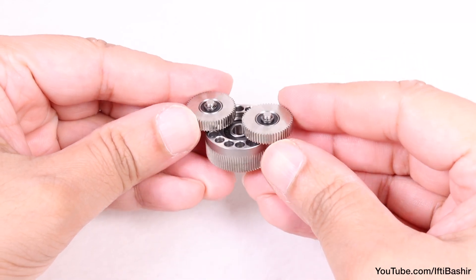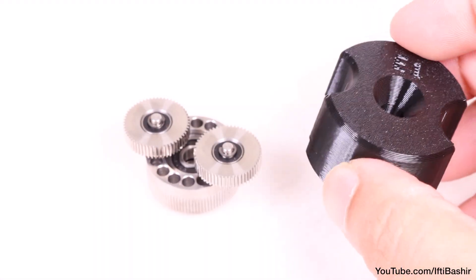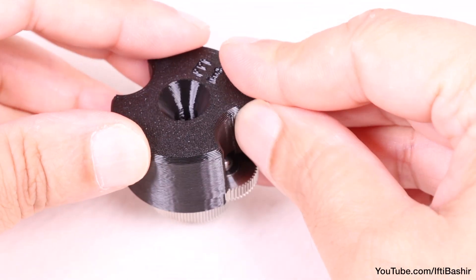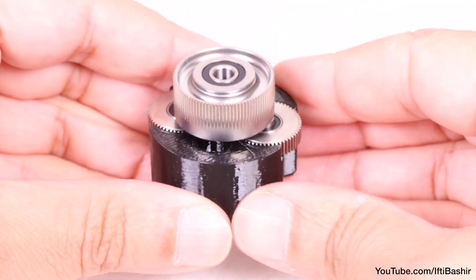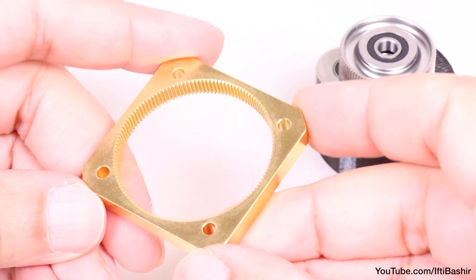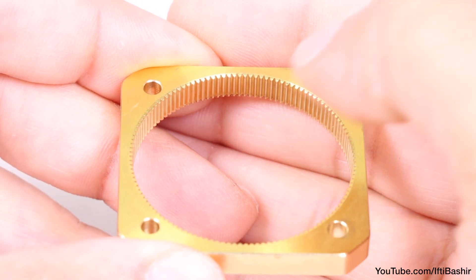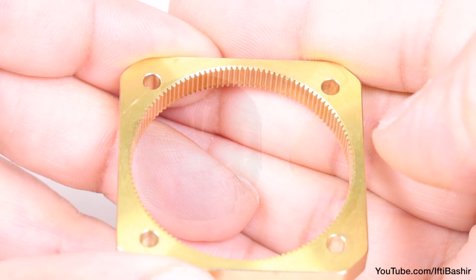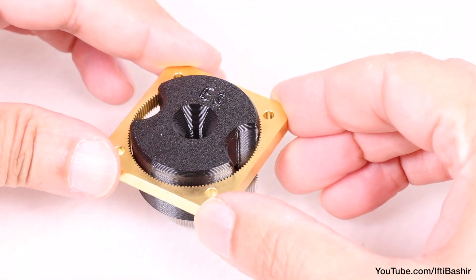It's back to the small extruder box for the main gearbox assembly. It's very important that this is done accurately. Begin with the gear assembly adapter alongside the actual gear assembly, and carefully lower the adapter down on top so the smaller top gears fit neatly into the pockets. Next, slide the gear ring over the adapter and down into position. Note how one side of the teeth is completely straight while the opposite side is very slightly chamfered — the chamfered side must face downwards.